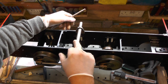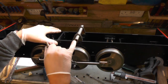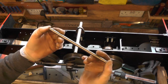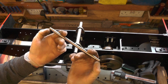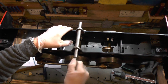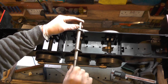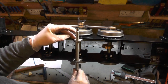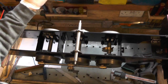Then you've got to make the shaft - 3/8ths diameter to suit the 3/8ths bore bushes - and that slides into the tube at the correct length. It's 6 and 7/8ths inches in between, and then there's half an inch on each side turned down to 5/16ths, which is a nice sliding fit in there. Those shoulders come up to that brass bush that protrudes a sixty-fourth of an inch outside the steel tube - and that's the way shaft finished.